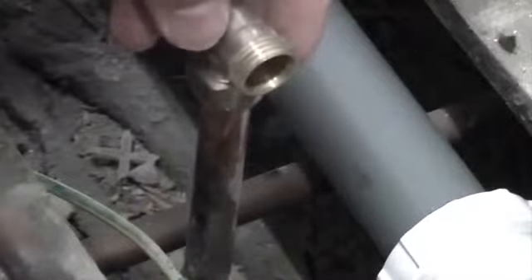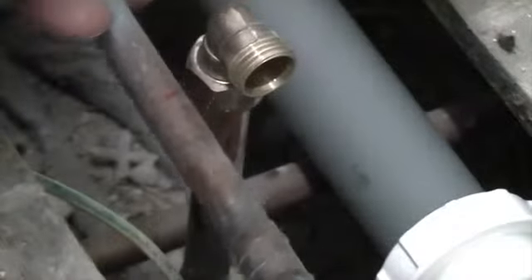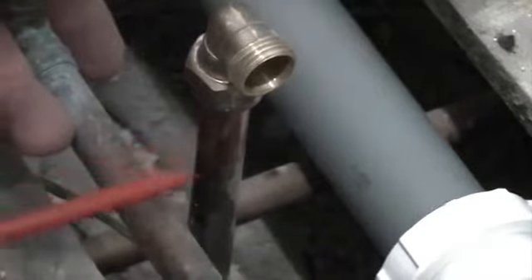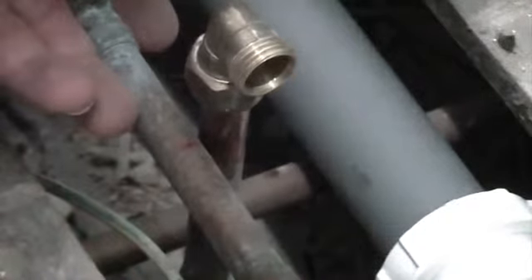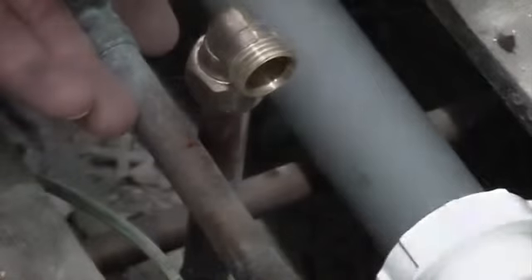...downstairs taps so that the water will drain out. So now I need to actually mark the length at which we need to cut this pipe, and it needs to be cut in approximately there. And once I've cut that one, I'm actually going to cut the pipe there as it comes up so that we are to the correct level, so that we've got the pipe as low as possible. It will then be running across the floor underneath the bath.